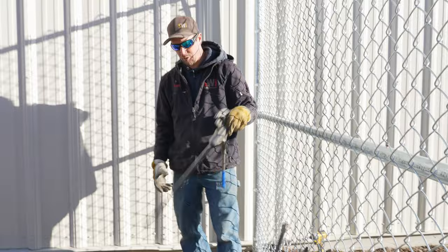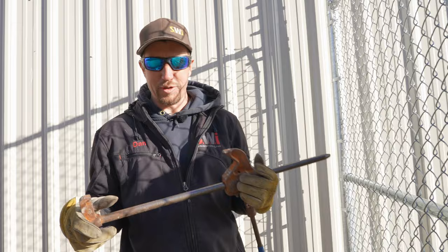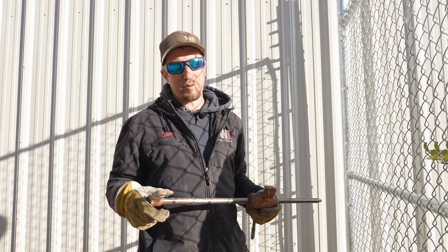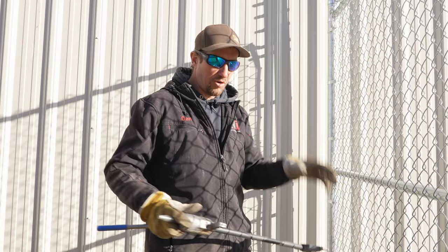What I typically do with the standard pull jack is use it on a short run — 50 feet or less. If it's more than that, I'll put a chain link rake on it, because anything more than that you're gonna put a lot of wear and tear on your pull jacks and wear them out a lot faster. Typically what I will do is guess on where I need to have that tension bar, put it in, and then stretch it. Most of the time I can guess pretty accurately to where I can cut all the slack out before it gets all bunched up. It's a little bit easier to have that bar go out past you versus back towards the fence because you're having to work around one more thing.